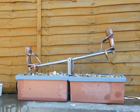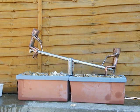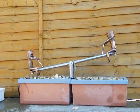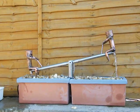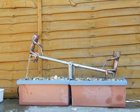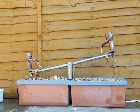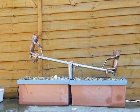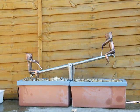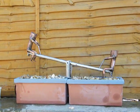The water is fed from one of the tanks into the centre of the seesaw, and in the centre is a rolling ball valve, so that when the seesaw is down, the ball rolls to a valve or to a washer and stops the water flowing downhill. So then it has to pump to the high side, and then that side falls because of the weight, and then the ball rolls down to that side, and so on.